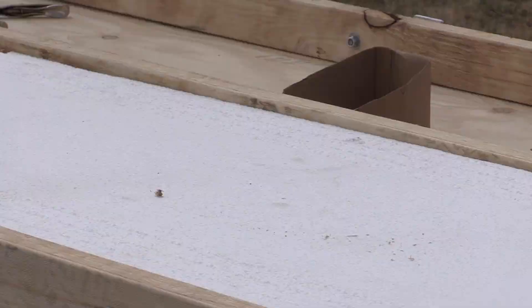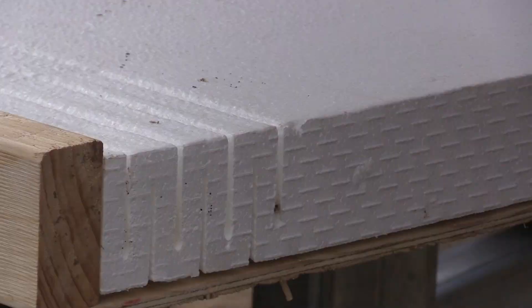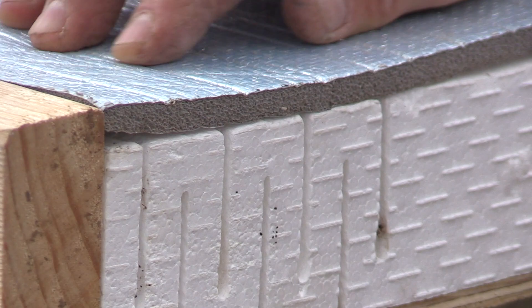This is a 60 mil outrigger and a 70 by 35 piece of timber, which leaves 10 more mil. We recommend using this double-sided aluminium foil foam — it gives you a bit of a radiant barrier on your floor. Your flooring goes on there and it makes a beautiful insulated floor in such a way that your flooring is not sitting on any steel.